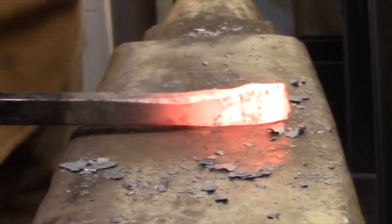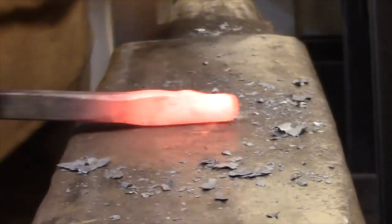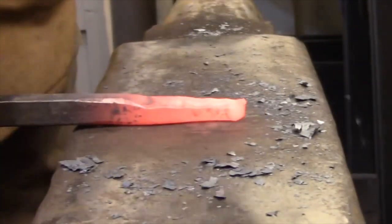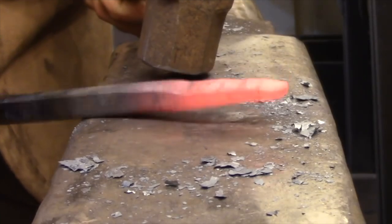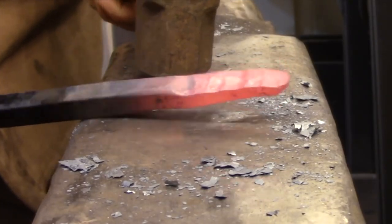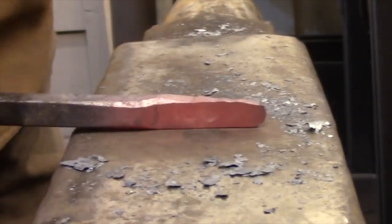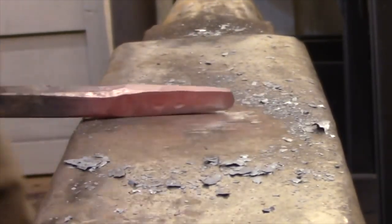If you're only forging a slight taper you can stay in the center of the anvil and just use the corners of the hammer to start forging the bar out. The rounded corner of the hammer drives into the metal much easier than the flat face, so it pushes the metal along the same way that a rolling pin does with a piece of clay. You use this technique to do the rough shaping, then go back to the center of the anvil and use the flat face to start refining that surface to the finished dimensions you need.